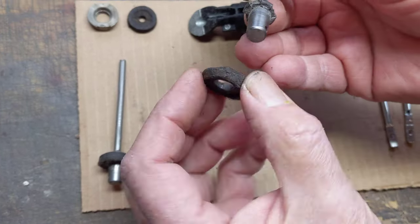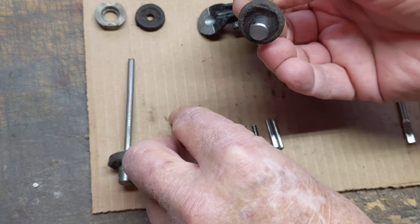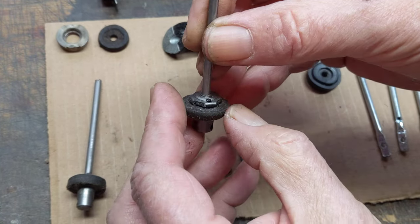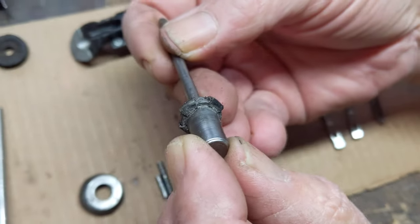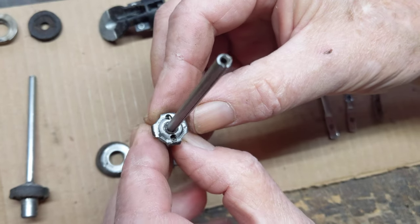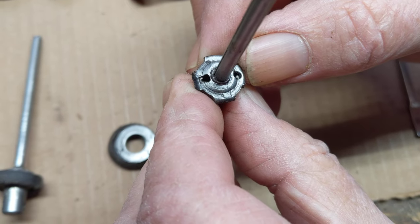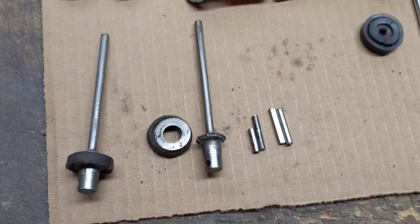The plug is tapered so that the washer only goes up a certain distance, and the reason is that the mainspring binds directly on the washer, not on the cross pin like the modern gun. The leather washer actually forms to the top hat, so when installed the mainspring pushes on the back of the washer, forming a really good seal. If you look closely, the top hat is crimped on the lip of the base of the air tube assembly and has two inlet holes. So back in the 1910s, 20s, and 30s, Daisy was running dual port air tubes — it's not brand new, but it's not current production technology either.